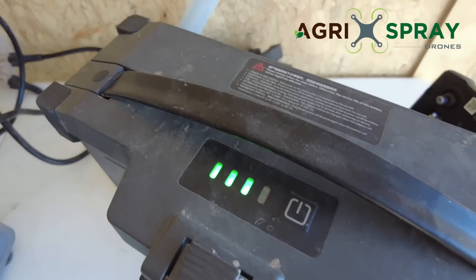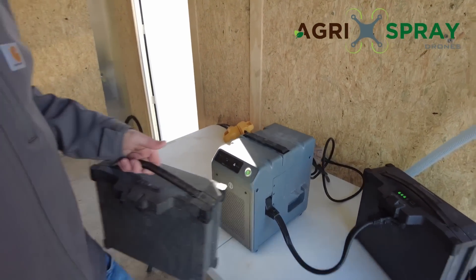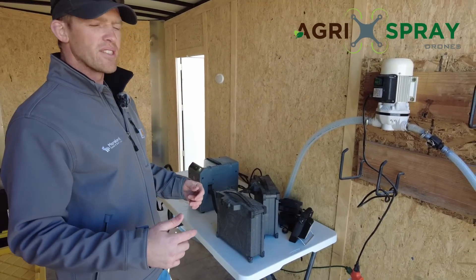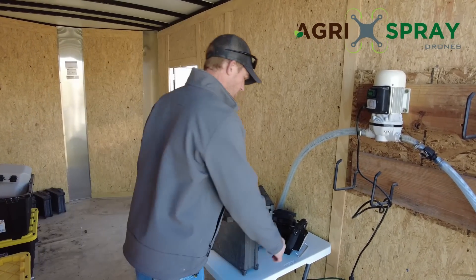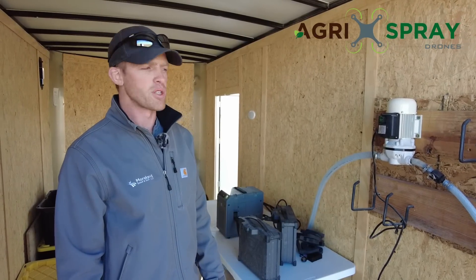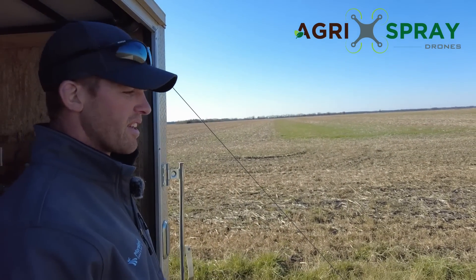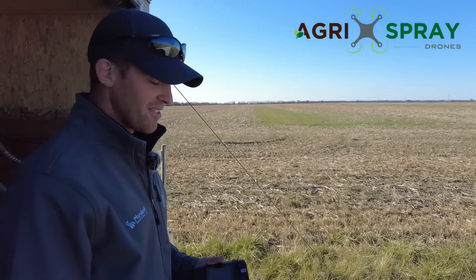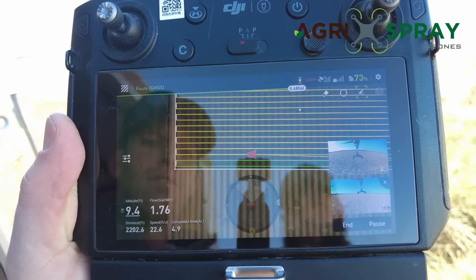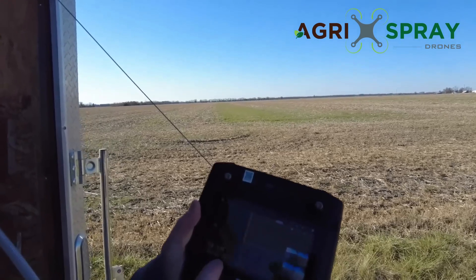This battery will likely be fully charged by the time the drone lands again. That's why we carry three batteries. The charger and generator charge batteries as fast as you deplete them — three batteries and one charger is all you need for all-day operations, as long as you have a generator on site of at least 9,000 watts or larger. When you're spraying whole-field application for typical farmland, this is what you do: sit back, get a lawn chair and a cooler with drinks, and watch your drone fly. The drone does all the work — you just refill it, replace batteries, and hit Continue. It keeps track of completed area per flight and total completed area; right now we've covered about five acres.